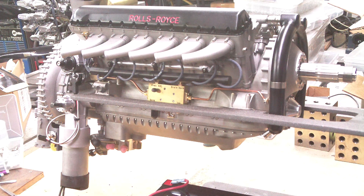The issue with this particular motor — and I'm really not sure that it's an issue — is that with the load it's dealing with, it's running at about 80% of its stall torque, and it draws some 75 amps from the battery. So I've got it hooked up here with a starter relay, and I'll demonstrate it now.